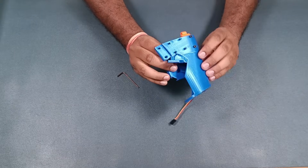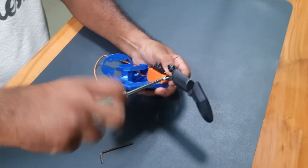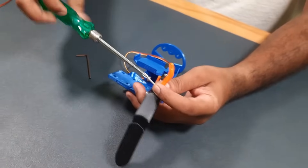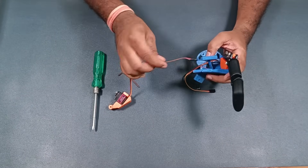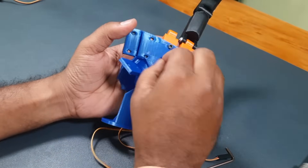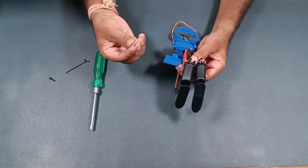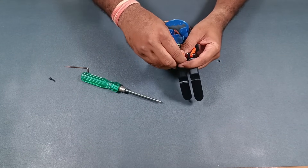As you can see, the first servo is now attached to the palm. Next, I will add a finger to the front of the servo using some bolts. Before attaching the servo link, we have to calibrate it, otherwise it will not function properly. I will repeat the same steps for the remaining four fingers and servos, then fast forward that part. Once everything is attached, we'll do a basic calibration again for smooth movements. Make sure all screws and bolts are tightened properly — if anything is loose or forced, the hand might not function correctly.